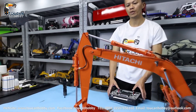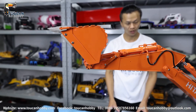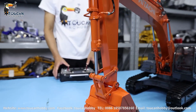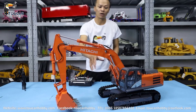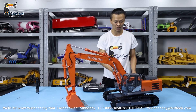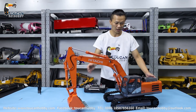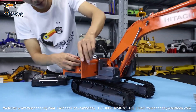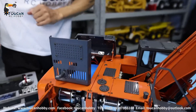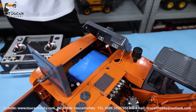The good thing about a double pump is that you have enough power to control the big arm and the small arm all at the same time. An experienced player will know that with a single pump, if you try to open the big arm, small arm, and bucket all at the same time it will be slow and sometimes one of the motions will get stuck. But with this double pump, there is enough oil flow — it will not get stuck. This pump is an imported one from Italy. The size is big, so the flow is high, giving enough power to make all the motions and all the cylinders move fast without getting stuck.